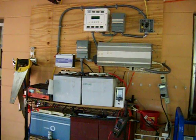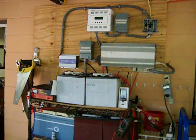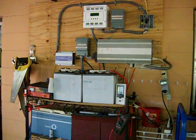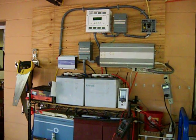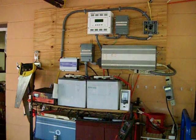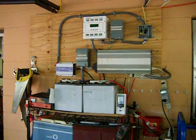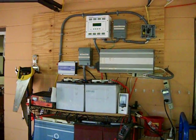I'm sure that when that 3,000-watt inverter kicks in and I use it — and I've used it a couple times — I know I'm losing at least another 10, 12, 15% there, which when you add it up comes out to about 20%. So if you're trying to power something that requires 1,000 watts, at 20% loss, try and have at least 1,200 watts up there.